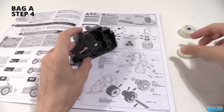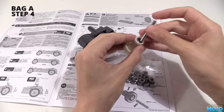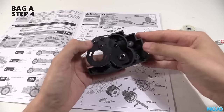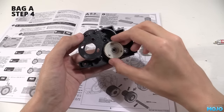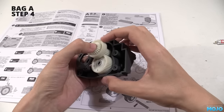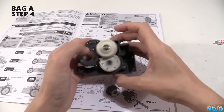When they are seated, you can really feel it. The idle gear can be made ready now — it gets a bearing in both ends and the shaft through the middle. The hardest bit is stopping the shaft falling out while moving the gear around. Another bearing gets pressed into the gearbox where the diff goes. As always, a dry fit is a good idea before we cover it all in grease. The diff fits in the large area at the bottom and the shaft for the idler fits into the recess just above.